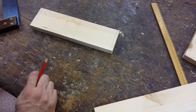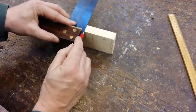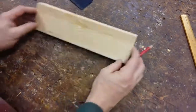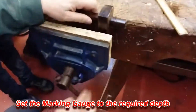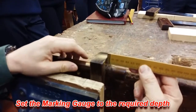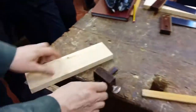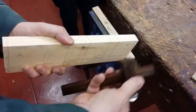What we need to do now is square the lines onto the edge, and I'm going to square it the whole way around. I'll do the far side a little bit later because it might be handy if you're locating pins in it afterwards and for centering it. After that, we need to set the gauge to mark the depth of the housing. The depth of the housing on this is 10 millimeters — you can see the stock, stem, and spur of the marking gauge — and it's been adjusted to a distance of 10 millimeters.